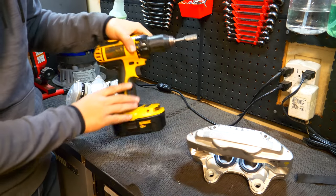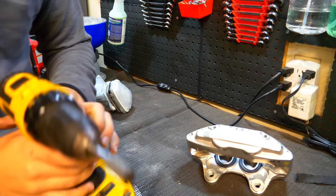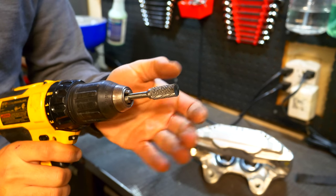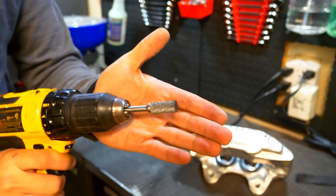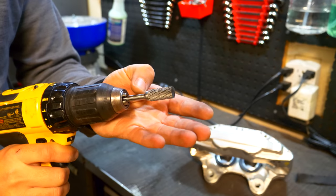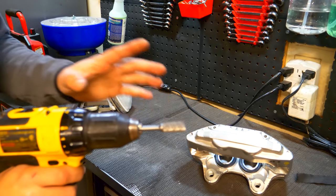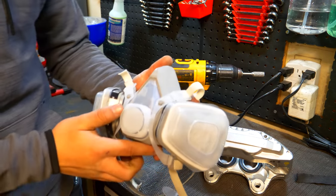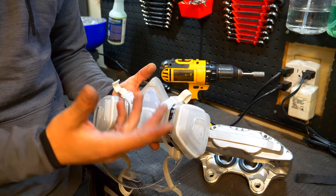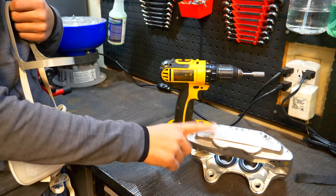To get that done, you're going to need a drill or a Dremel, but the most important part is this carbide milling bit. This is just one piece out of a big set and this is what I'm going to be using to shave down the aluminum. This stuff works also for steel, but because aluminum is very soft it's going to come off really easily and smoothly. You're also going to want to use eye protection and a respirator while you're doing this — you don't want to be inhaling any of those aluminum chunks or flakes emitted into the air.